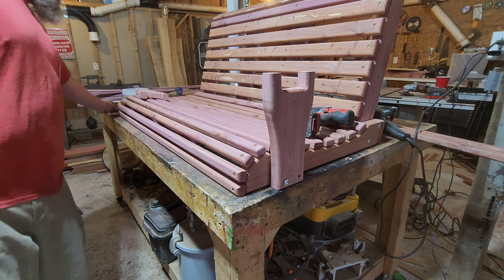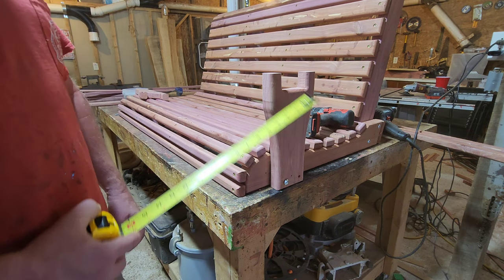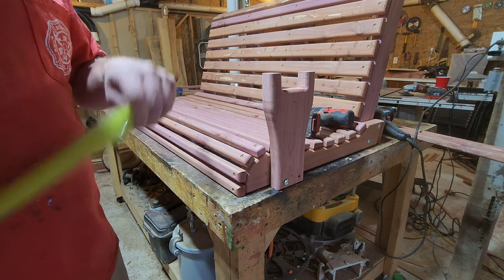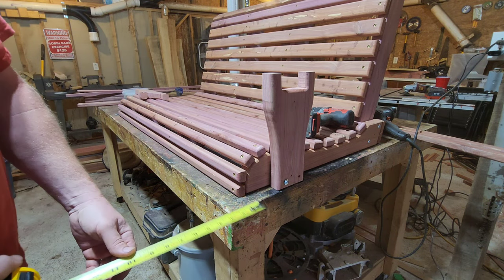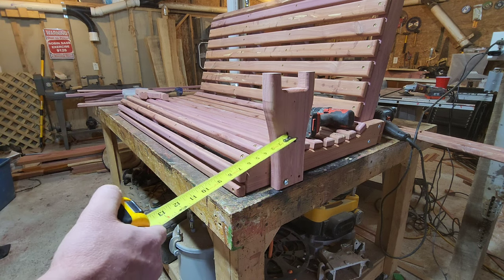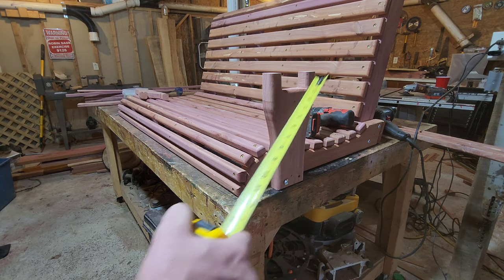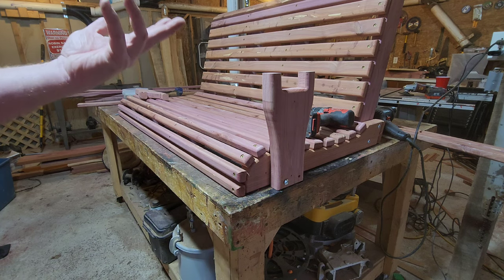Well, if you're wondering about the measurement, now, like I told you, if you're not doing cup holders, you would just put a regular 2x4 up through here, 11 inches high. That's how high I set this, 11 inches. Measuring back, what this right here is made from is a 2x6. That's how wide this up here has to be, to accommodate room to make a 3-inch wide cradle and still have enough wood material left. This is how this all came about.